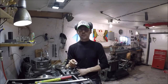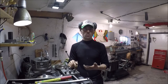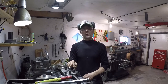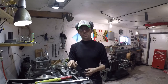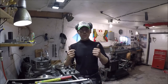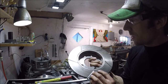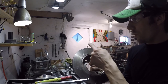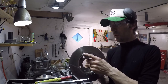He came over last night and dropped off the discs. When I did my brake discs last time I wasn't perfectly happy with the result, but it worked out okay. I thought there might be a better setup, so I brainstormed about it out in the shop and in about 15 minutes I came up with something. I am so happy because the result is perfect. I'll quickly show you the disc — they're perfectly straight and the mill didn't wander, which it did a little bit last time.